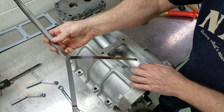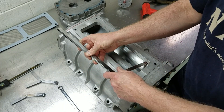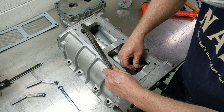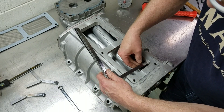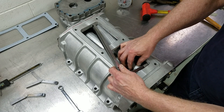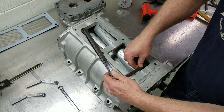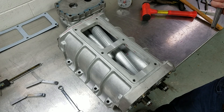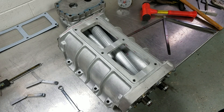I do the same thing on the opposite side. Even though you probably won't get this lucky, I'm actually within about a thousandth of an inch — about 15 on one side and a tight 14 on the other. So I'll be able to leave the side clearance alone. I'll double-check the bottom clearance one more time, and if it looks good I'll snug up all the remaining bolts on the case, then take it over to the drill press and run a reamer through the dowel pin holes to fit the new dowel pins.